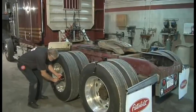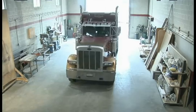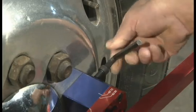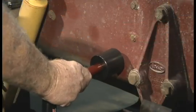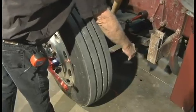To begin, pull the tractor into the shop and bring to a slow rolling stop, then chock the wheels. Attach the alignment bars to the wheels on each side of the front steering axle, and be sure to level each bar before proceeding. Place the hub adapters on the side of the frame behind each wheel and attach a laser to each hub adapter.